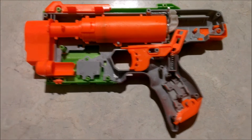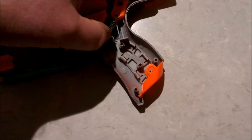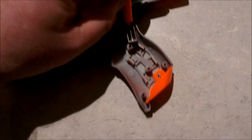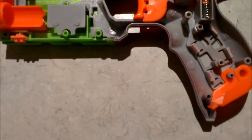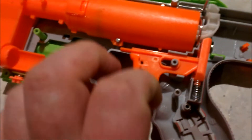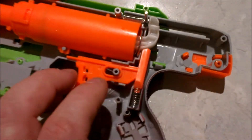And this is what we are left with. Looks like I've already dislodged the trigger mechanism. Okay, so that's the trigger mechanism realigned. I'm assuming there's a little barb on the bottom of the main rod that, when it comes back, latches onto the top of that little trigger arm. And when you pull your trigger, it disengages and releases it.